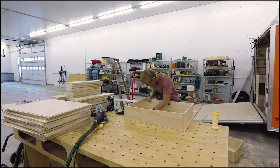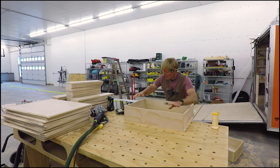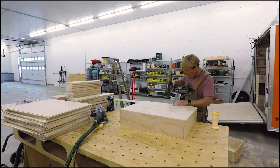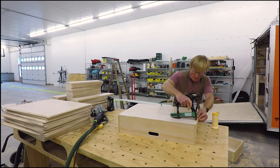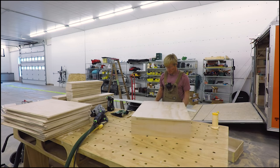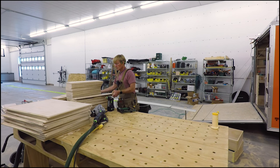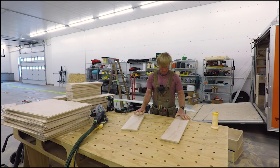On the big drawers I pre-assembled the box and it slowed me down — hard to fit — so I went to putting the pieces in separately, and it went perfectly. I used quarter-crown, inch-and-a-half long staples, and a little block to make sure I didn't get any shiners on the inside of the drawer. Still got a few and knocked them out, but for the most part it turned out pretty good. I had to repeat this operation 20 times — a little monotonous, but I was listening to a podcast and it was all set up correctly, pretty hard to put together improperly.